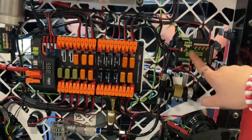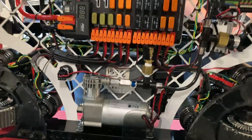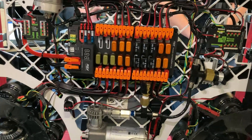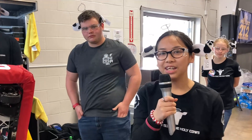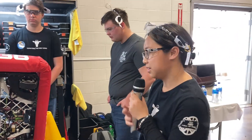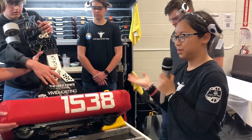We have our PDH right here, which controls all of our power. We have our PCM, which is our pneumatic control, and here's our compressor and canister for it. For wiring, we have very high standards in terms of visuals. We make sure when we do training or teach our rookies how to wire that all of our angles are 90 degrees. We always double-check everything so there's no system failure. We have a lot of rigorous tests that rookies go through at the beginning of the semester, and that helps with having good wiring in the end.